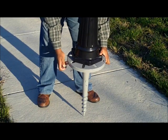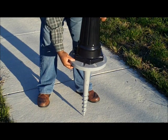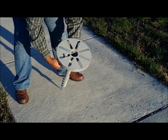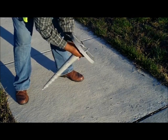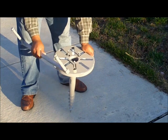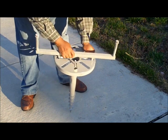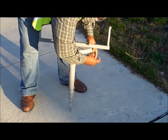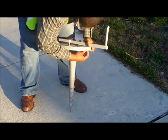Use the lamppost base to determine which slots to insert your screws. Use tape to secure the screws to the appropriate slots. Then place the installation rod into the opposing unoccupied slots and use rubber grommets to secure the installation rod into the ground screw.